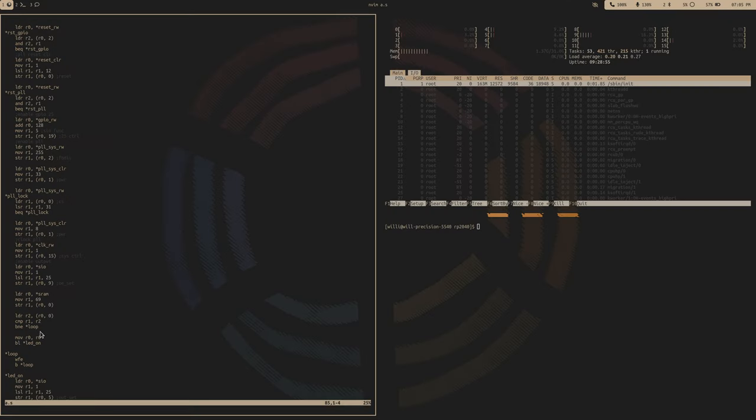Now that we've established that, let's have some fun with the memory striping. Instead of storing 69 at the very beginning, let's store it 12 words from the base. So we're still in bank 0, but we're at a weird offset. Let's load that bank 0 address in for the non-stripe mirror. So SRAM bank 0, and when we load that in, we're going to load it at an offset of 3 words. If the mirror works, we should get the same value back.